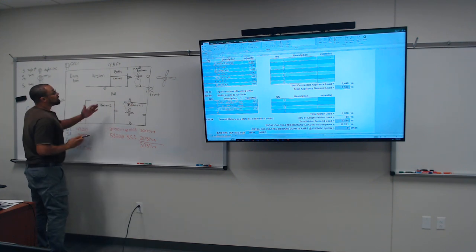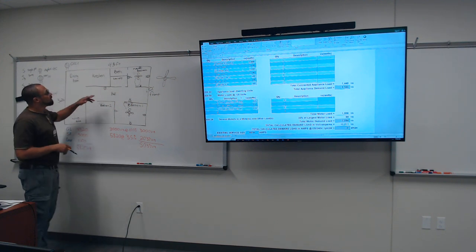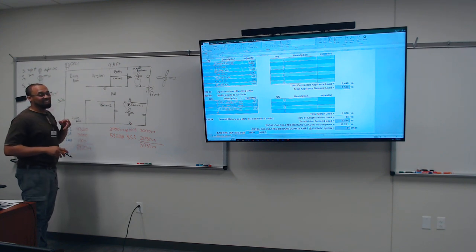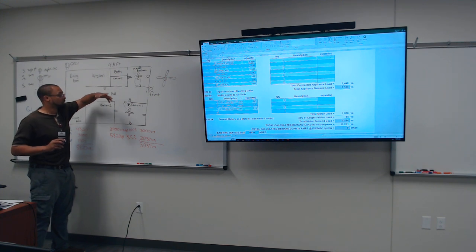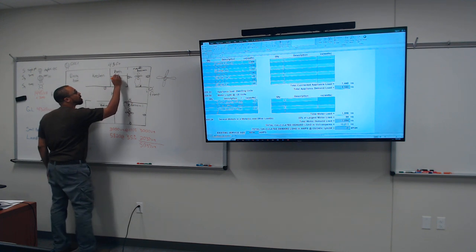Okay. All right, let's go into the bath and the laundry. Now, you already know that it is required to have a what? GFCI. And guess what? They're back to back. So I'm gonna put the GFCI plug right here, and I'm also gonna put a GFCI plug right here. The bathroom is only required to have one plug. Majority of bathrooms only have one plug. Sometimes the big bathrooms have two plugs by the sink. But in this small home, we're gonna put the GFCI right here.